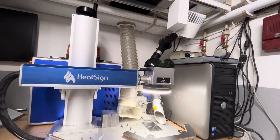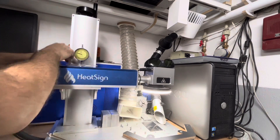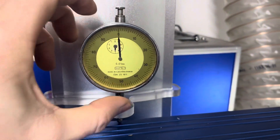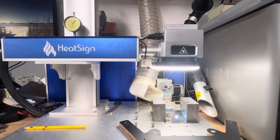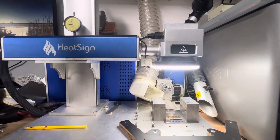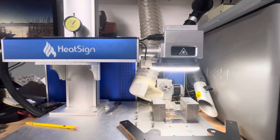How to use the device? It is easy. We slide it onto the dismantled column cover and put the dial indicator in the hole. The device should move along the column with slight resistance — it should not slide under its own weight, as this will cause the readings to be falsified. We set the galvo head at the focal point, then set the dial indicator so that it indicates half of the indicator stroke. In my case the dial indicator has a stroke of 10 millimeters, so I set it to indicate 5 millimeters — this is our starting point. I then make subsequent engravings, each time lifting and lowering the galvo head by a fixed stroke of 0.20 millimeters. Note how the values shown by the dial indicator change and how this affects the engraving process.